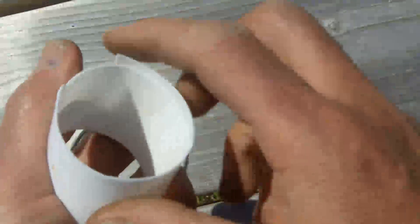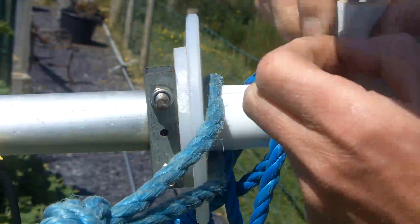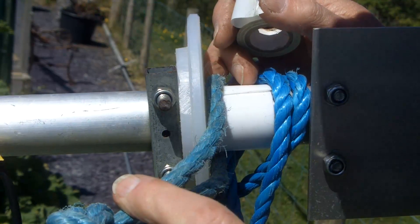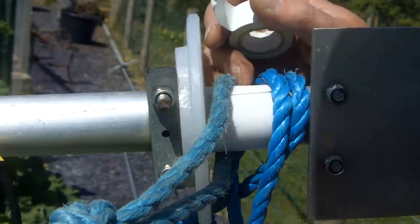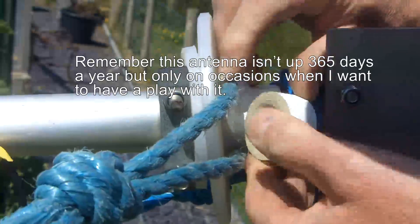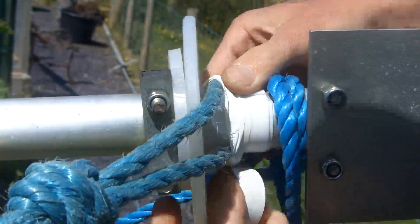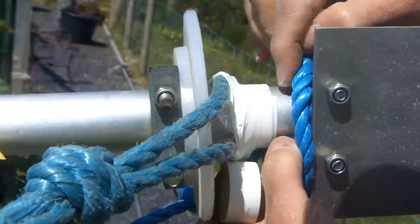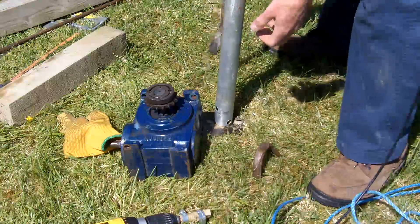The only thing you'll find that's slippier than this is a politician. I've got the PTFE in place and I'm going to put some tape around this — this is my fixed guy on the right-hand side when I'm up at the house, the one that determines where the mast falls. I'm taping the PTFE and the guy rope together so that the PTFE is held in one fixed position. Any rotation and friction will be between the mast and the PTFE, not the PTFE and the rope.